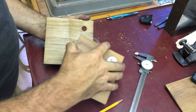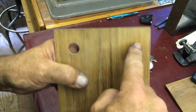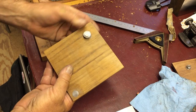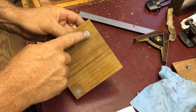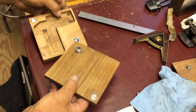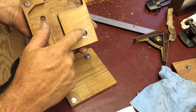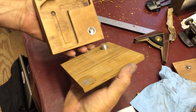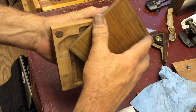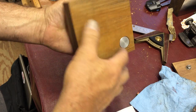You can see how hard it is to get apart — the magnet is really holding it. After we get it all glued and the hinge glued in, we'll sand it. Here's the top — that's the magnet end of the hinge, and this is just a piece of steel I turned down, just a little wafer. The magnet is over here and the rest of the hinge. I've left the steel part out of this hinge just to show you how nicely this works — it just slips in there and spins 360 degrees, but it just catches right on that other magnet. That's your catch.